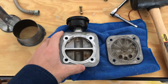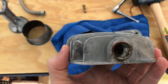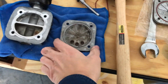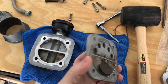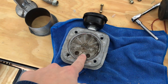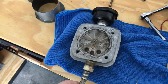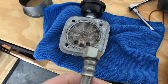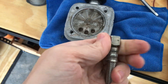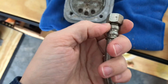This is the cylinder head — it's fine, I'm not replacing it, although I did notice some casting issues. These are the valves: this is the inlet valve where air comes in, and out through there goes to the tank. That side had the hose attached, and this side was supposed to go into the compressor. This little stem in there had just popped out.